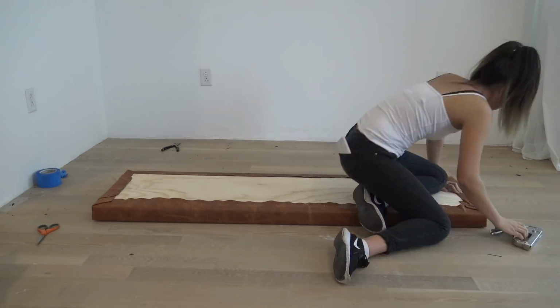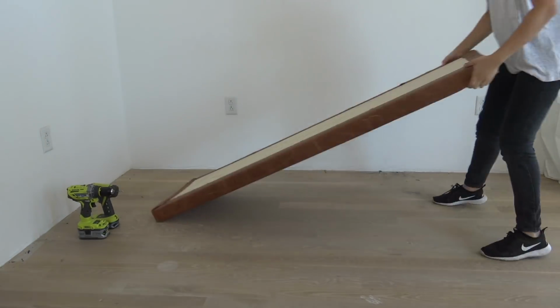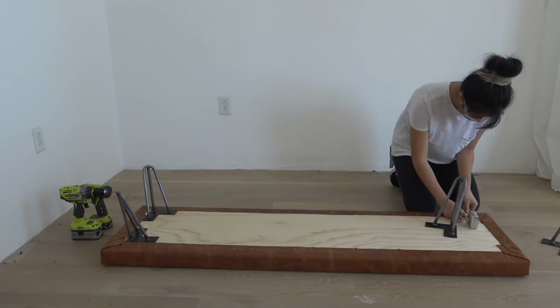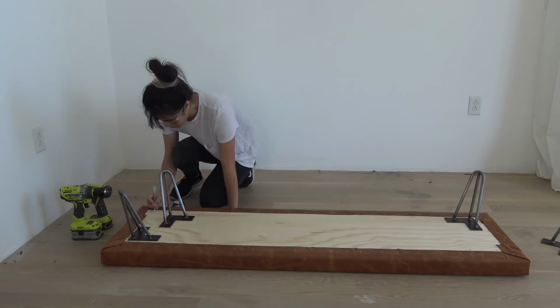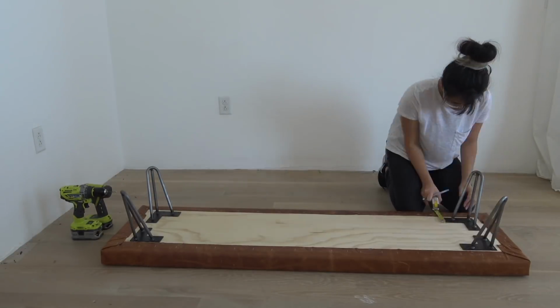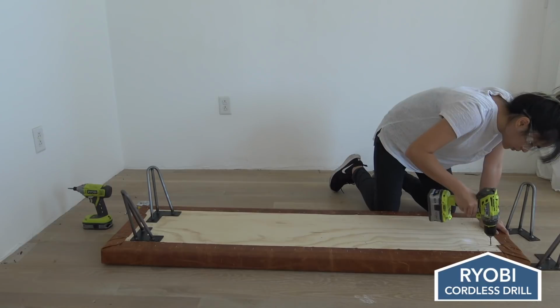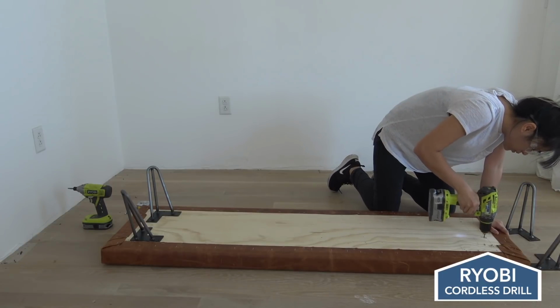I used 10-inch hairpin legs. I will leave a link to where I got them in the description box. I did some field measurements to make sure I liked the placement of the hairpin legs. I used a pen to mark out the screw holes onto the plywood. I pre-drilled my holes, making sure I didn't go all the way through.